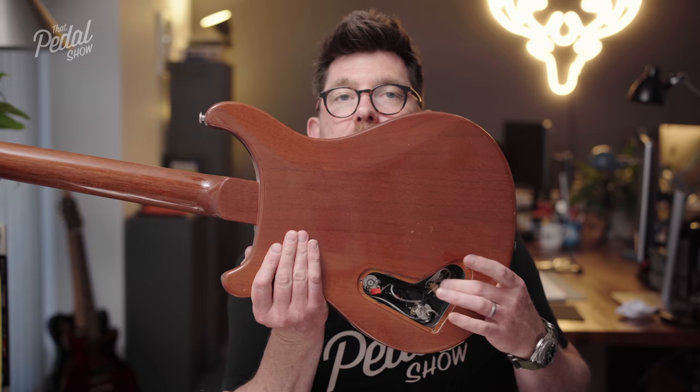I just wired the switch the wrong way around. So that's easy. So we take, sorry you can't see this, that wire off there, that wire off there. I just had a bit of a spatial awareness moment with the three-way switch. So you go on there. That's Dan texting me. I just texted him to say it's never going to work. And he texted me, I'm going to guess, of course it will, you idiot. Switch here has connectors left and right, depending on the position of this. I just got them the wrong way around, that's all.